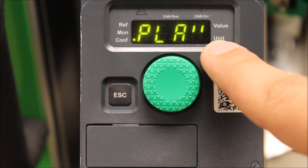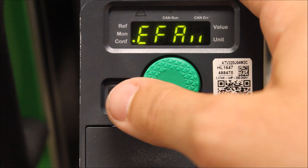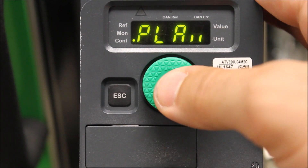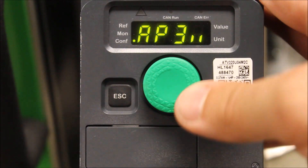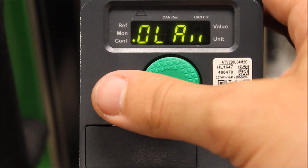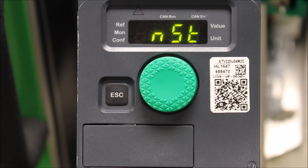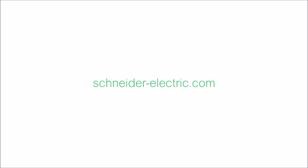Basically, if two dashes are on the top, that means they're programmed. If you press Enter once, that means they're not programmed. So make sure you go into each section and see which ones are on the top and which ones are on the bottom — that's how you know whether it's programmed or not. Right now we have nothing programmed for an alarm group, so it's unassigned. But if something is programmed, like a 4 to 20 milliamp loss, you can see if the dashes are on the top or not. That's basically how you check how the ATV320 is programmed for the alarm group for 4 to 20 milliamp loss.